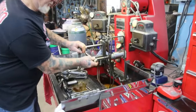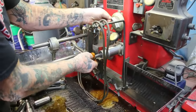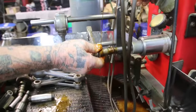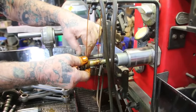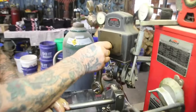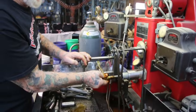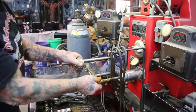We take that. This goes a lot faster because it's brass — comes out a lot faster. We have another dial indicator here — that checks out. We're going to take out another six thousandths of an inch and just keep going back and forth until we reach that measurement. Pretty simple — it just takes time.